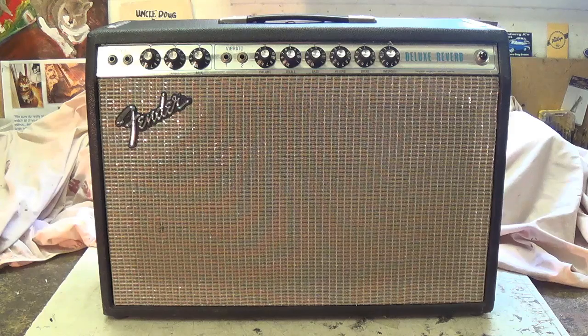Much has been speculated about the effect of output tube bias on tone, amplitude gain, and the onset of distortion. We're told that an optimum PD for grid-biased output tubes is 70% of the max PD for the tubes being used. We're also told that hotter bias results in either more or less headroom and more or less gain, depending on who you're listening to.